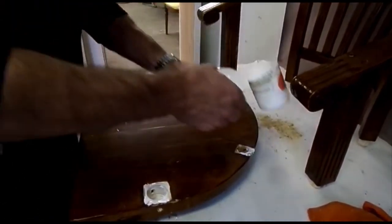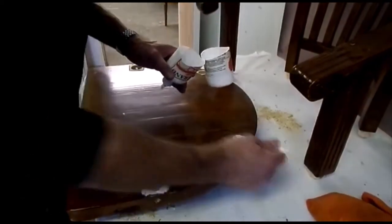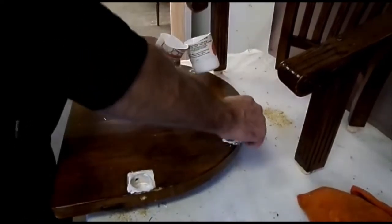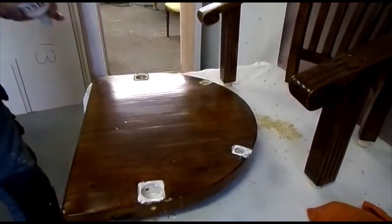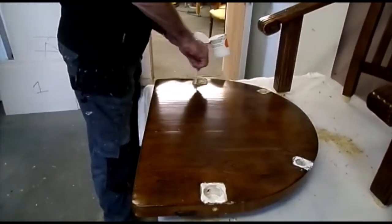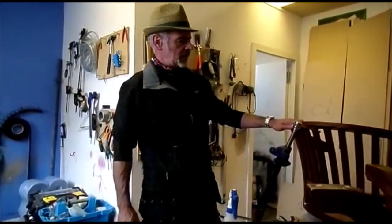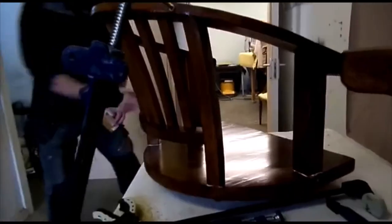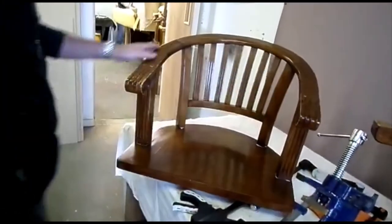There are going to be a couple of holes and dings around these areas — some of the wood broke when the pieces were separated — but we'll just use a filler to fill them, and if we need a bit of colour we can apply a bit of lacquer or stain to hide it. Those are very small repairs. Having gone through the dry fit stage tells you how the chair likes to be manipulated to be put back together, so when you apply the adhesive you already know how you're going to push it back together. It's quite quick, and you can see it's come back together fine.